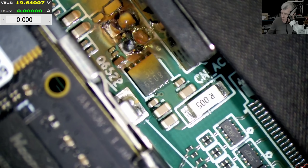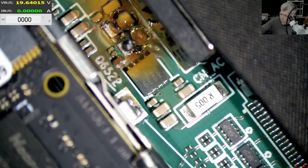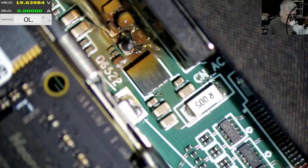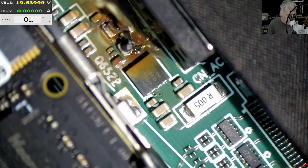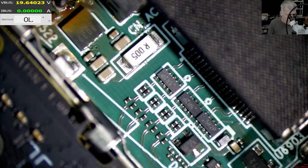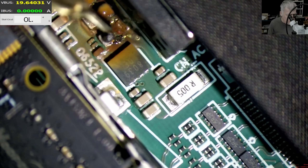Okay, that's not the issue. The problem is to find out why the inductor exploded. Do you think the board is shorted? Let's check the board with ground. It's not short — no short. Charging port is not shorted. Main power L is zero ohms — check that on the screen. So the main power L is shorted, that's why the inductor exploded.